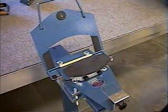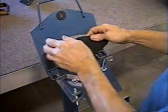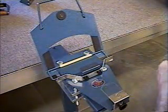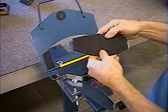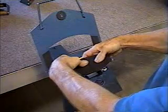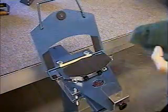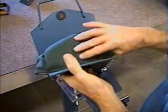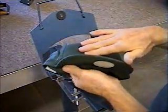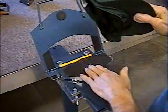Now there's another hat that's difficult to do. Take this platen off — to remove the platen you simply turn the screws underneath — and put on a platen that has a slight groove sanded into the rubber. Turn the thumb screws back on. This hat has a seam running up through the center, and that seam is a little thicker than the material, so with this groove cut in, the seam will sit right down in the groove.